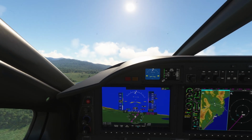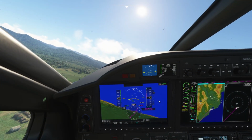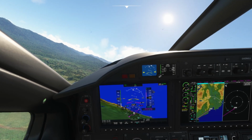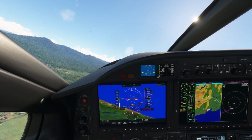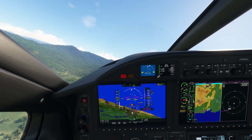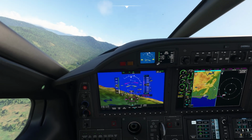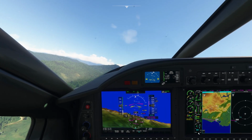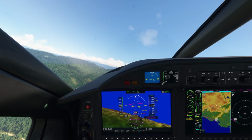Like I said, I was doing a lot of this VFR today. Sort of having some fun. Well, let's go ahead and turn our flight directors on. Turn that yaw damper on. Let's pull power back. Inertial separator can be turned off. Watch your torque. Torque's going to increase with the inertial separator turned off.